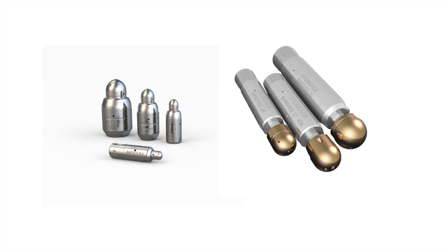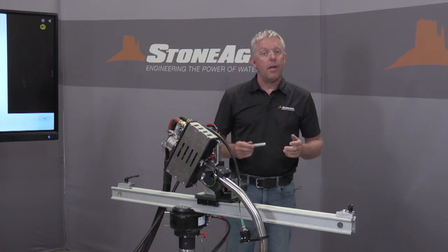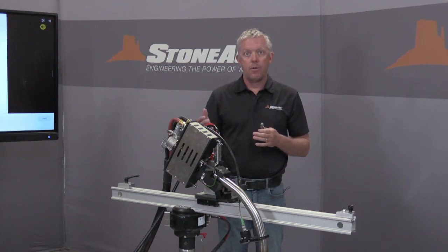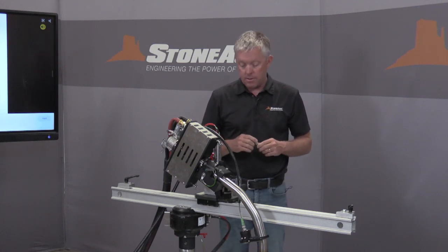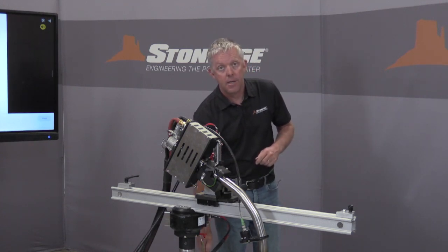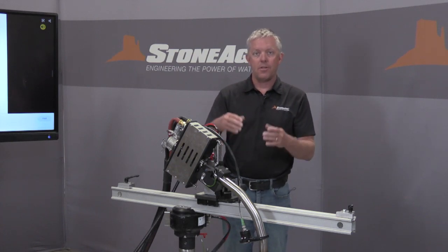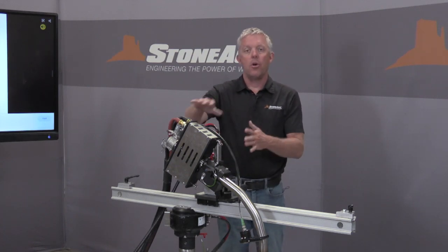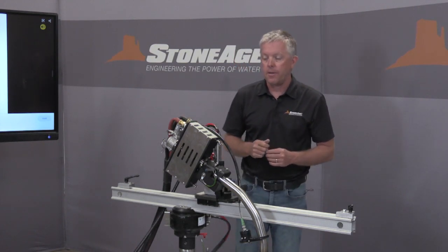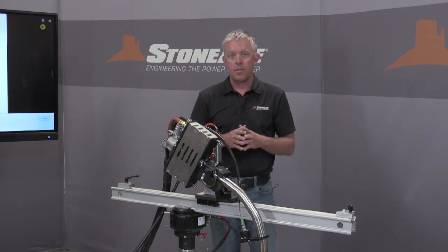And that's something to pay a lot of attention to when you're running this type of equipment. You can be running a universal head or a head with too much pull, which just adds a lot of demand to the tractor, which maybe isn't needed in any case at all. And so we can offer you a polishing head or even what we call a neutral balanced head. So it's not putting that load, with the weight of the hose, the water in the hose, and the jet angles of the tool, putting too much load on the tractor. So we can offer you several different techniques, science and water blast techniques to help make your job as efficient as possible.